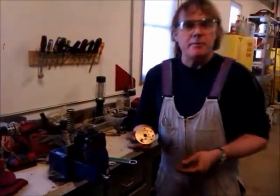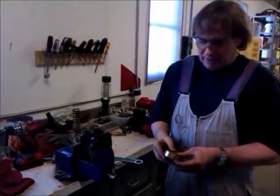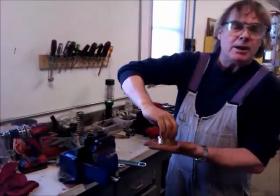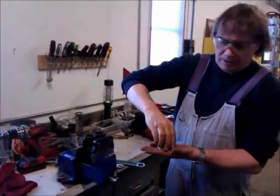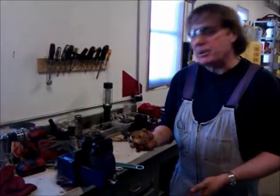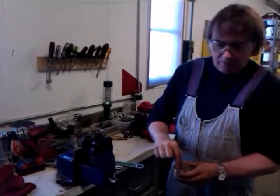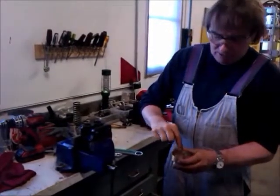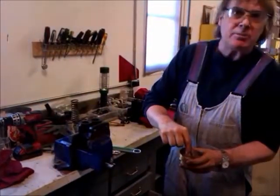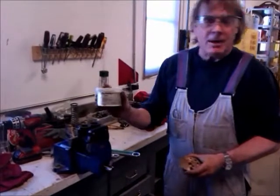What we're looking at here is a bronze rotary valve out of a typical conventional streetcar brake valve. They tend to be bronze and they rotate on top of a cast iron seat. Being different materials, you want to use a specialized lapping compound. Usually the telltale is that you'll feel a little nick or imperfection on the surface with your fingernail. If you feel it, it probably needs to be lapped, and we just use this U.S. Products Garnet lapping compound.